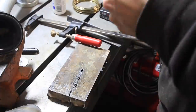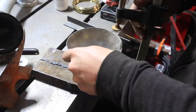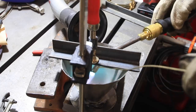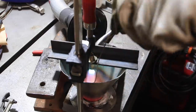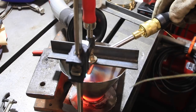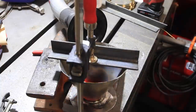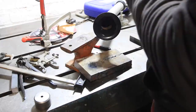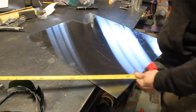You're going to have to combat warping and heat anytime you're brazing or soldering, so having a nice tight fixture is really important and it's basically the only way to guarantee a tight joint. I've got my fume extractor running as well, because you want to make sure you don't breathe in any of the chemicals coming off the material, the brazing alloy, or the flux. Originally I was going to TIG weld this project, but at the time I didn't have any stainless rod, so I figured why not give brazing a try. This is my first time doing any stainless steel brazing and overall it was a really great learning experience, because this is how you prepare yourself for the next project for a client — by doing projects like this for yourself and finding out where you can make mistakes and learning from them.